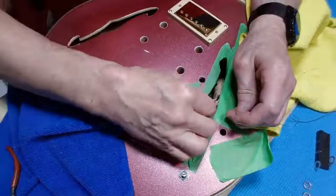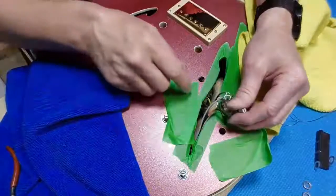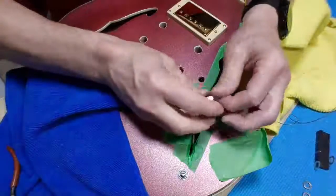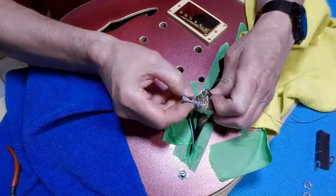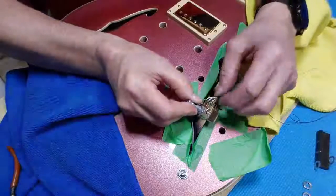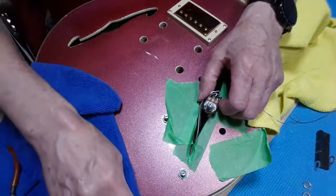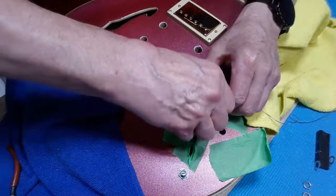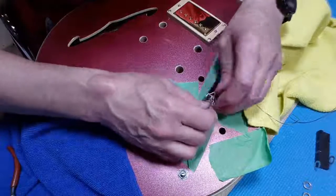Okay, so I rewired the first switch, and I also added a trailing resistor down here for the split, and I put my standard jumper between this pin 1 going to ground and using it as a common for the shields. And with the help of my air bridge, which is down here just out of sight, I have been able to determine that the split works okay.